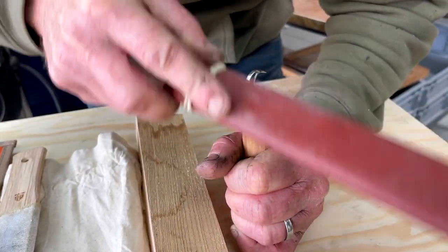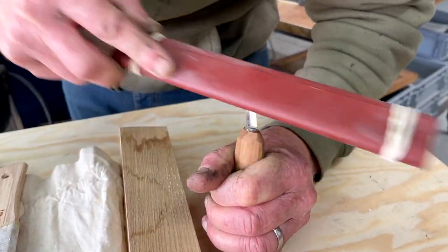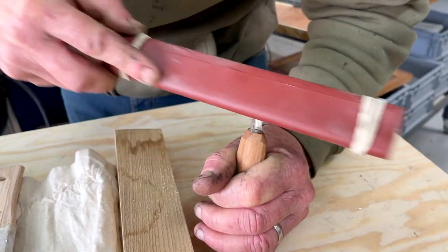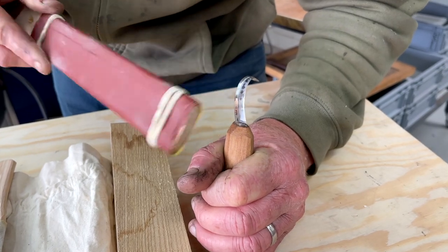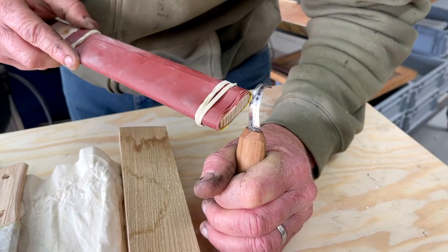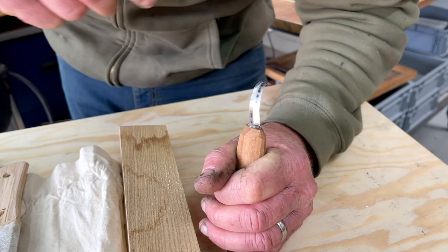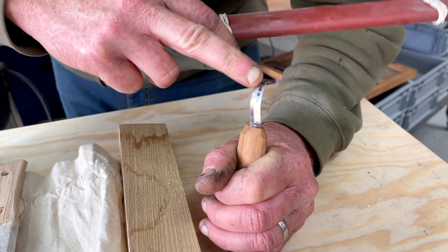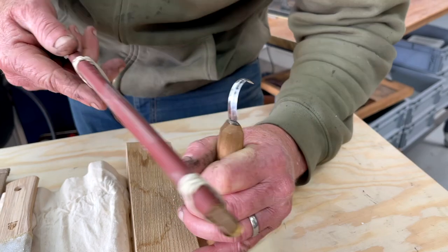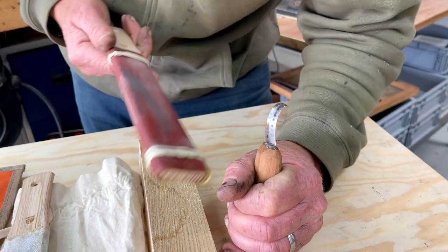It's quite good having a good light source — I'm right next to our big open double doors. If you're in a dark workshop, get a nice angle-poise lamp. That's pretty much removed all that pen; there's a little bit left where it's slightly hollow ground, but that'll come out with time. Make sure you're removing pen from both the back and front of the bevel. If you increase that angle too much you'd make it sharp quickly but end up with a very obtuse bevel — we're trying to maintain that edge geometry so it cuts sweetly with a nice gentle slight radius.